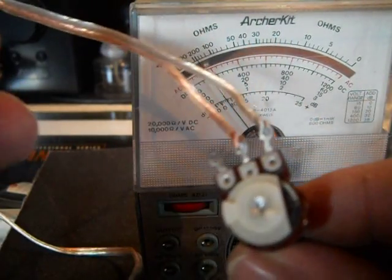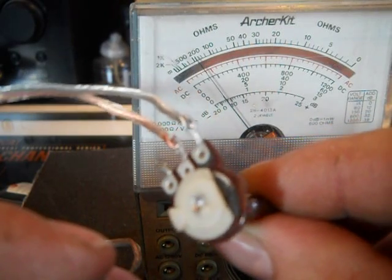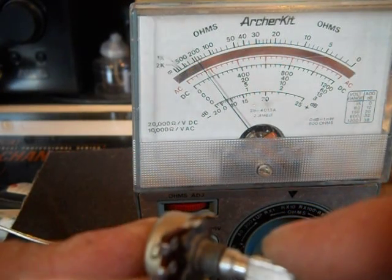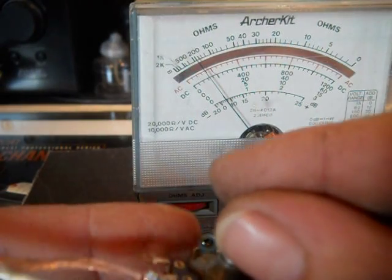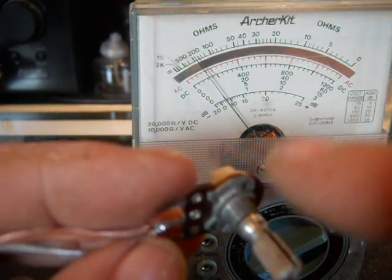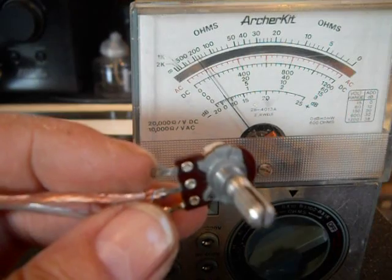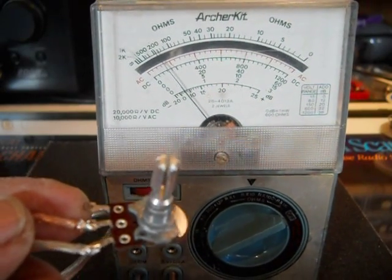You get the idea of what one of these looks like. Do like I learned — just start taking it apart and looking at it. I have taken these apart and cleaned them. Don't scrape anything on there, but I have taken them apart to spray them out better. If spraying it didn't seem to work that good, I would actually take it apart. Just be careful bending these little tangs up. Sometimes you'll run across one to put on a radio to replace, and you'll find a little piece sticking up on here. Take a side cutters and cut it off — you could dremel it out. Sometimes you'll find ones that had a little peg on there that's in your way. Don't be afraid to cut it off. But that's it for this little how-to video. Thanks for watching.